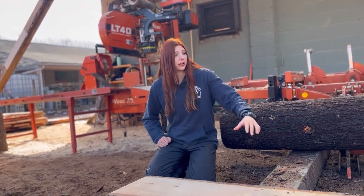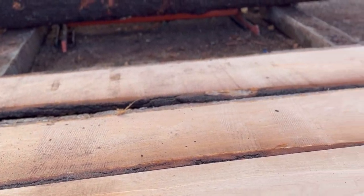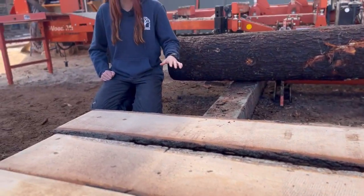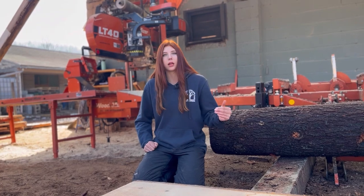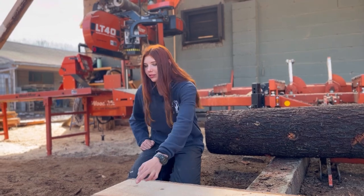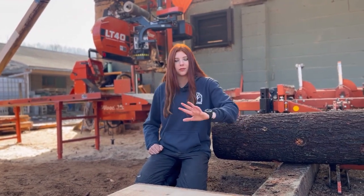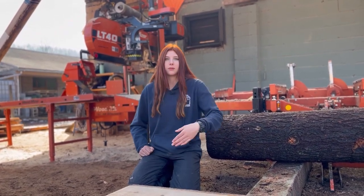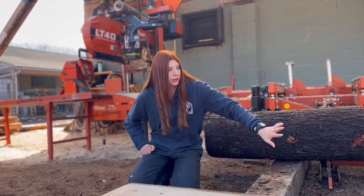If you take a look at these clear boards or semi-clear boards that I set aside here, they're flitches — they have bark still on the sides. This is because they came off of the outer layers, and this is what we find it's usually like with the clear pine. Only the outer layers are the clear pieces. These are just semi-clear; there are two knots on these ends here. But what we are thinking is just cut off two feet and sell it as an eight-foot clear board instead of a ten-foot, because these are all ten feet — cut off the end and it's still clear.